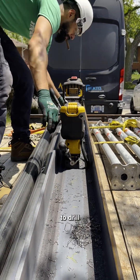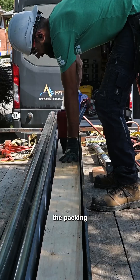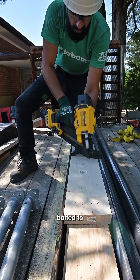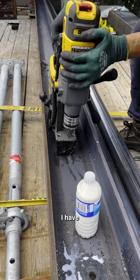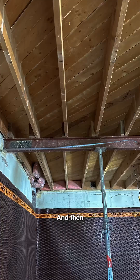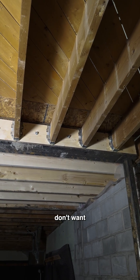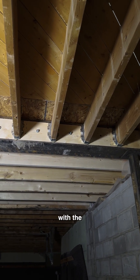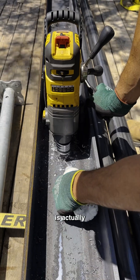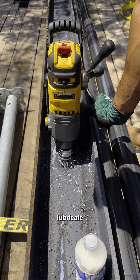We start with a bare beam and I need to drill between each joist cavity. The packing - the wood pieces that fill out the beam that we put our hangers on - needs to be bolted to the beam. I'm using a magnetic drill. I have lines and X's marked: the X's are my drill holes and the lines represent the joists. I'm using the DeWalt FlexVolt mag drill. That white fluid is not milk - it's a liquid oil emulsion used to cool and lubricate the bit.